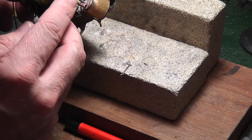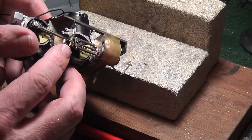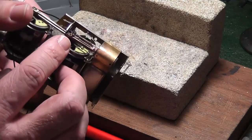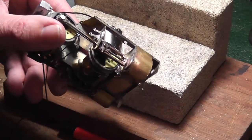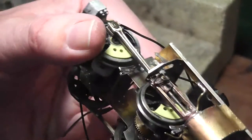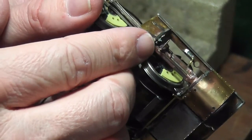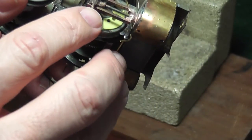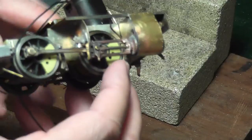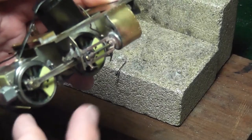Similarly, this anchor link pin was silver soldered to the bottom of the crosshead. There's a very small, fine pin here, which is only about 0.7mm diameter, and that's silver soldered to the bottom of the crosshead. The advantage to that is, apart from being absolutely solid, it's not going to come unsoldered when I come to solder a little bush on the end to restrain the anchor link.